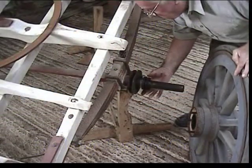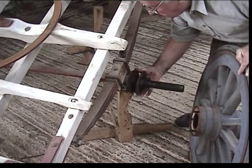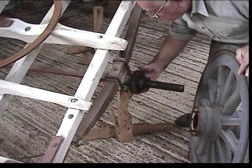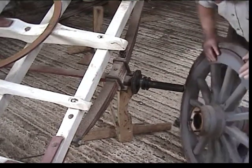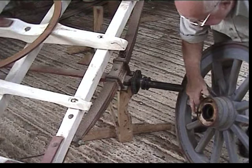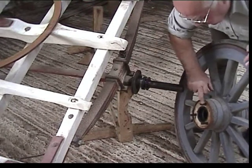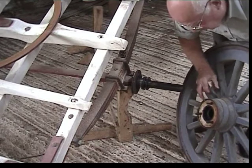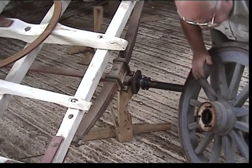The ridge retains the grease, with a retainer there, a soft washer there, another soft washer, and a ring to retain the wheel from sliding off. It's quite simple but effective. There are three studs that run into that ring and they're of a coarse Whitworth thread, used a lot in the time. Sleeved with metal to ride that.